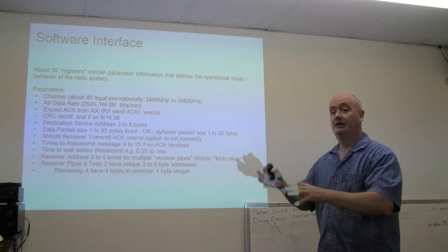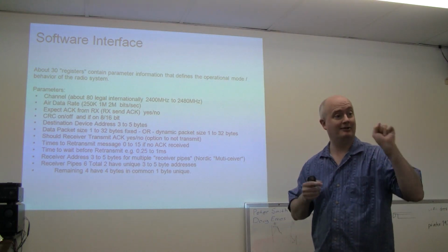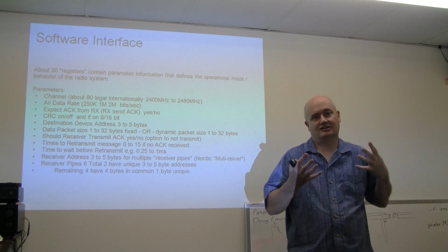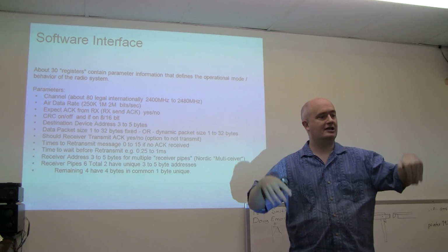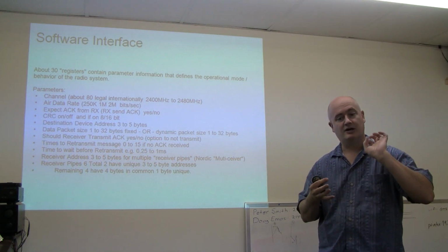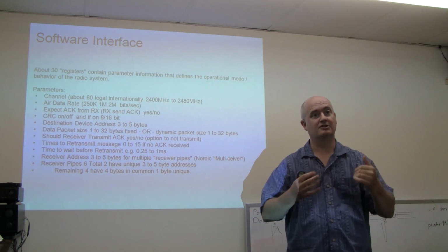But if we are, here's what the radio chip will do. If I send Paul a message, it immediately switches over to becoming a receiver and listens. And then I just caught the response. Okay, and I'm done, because Dick is feeding me the information, I'm the radio chip, and he has quit feeding the information. I'm through. I can go to sleep, and that's what the chip will do all automatically. It'll send a message, and if we are waiting for a response and we get it, then good. I'll set an interrupt flag to let Dick know that the message was transmitted successfully.